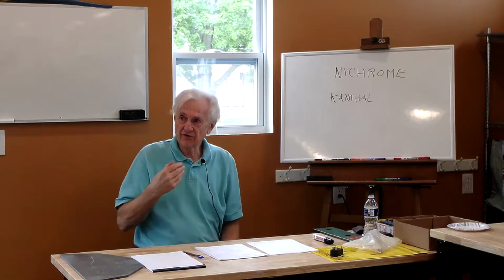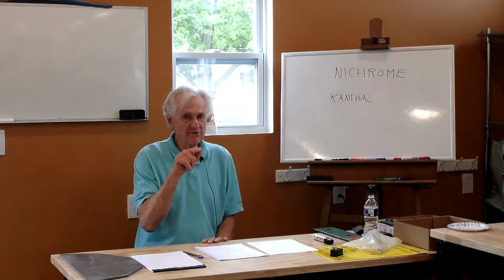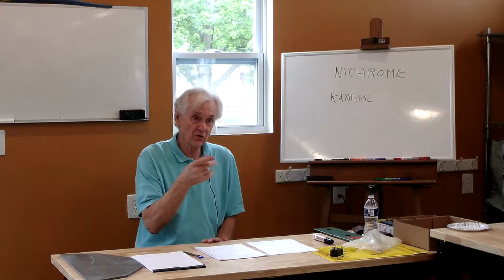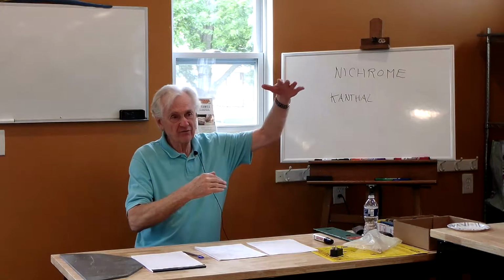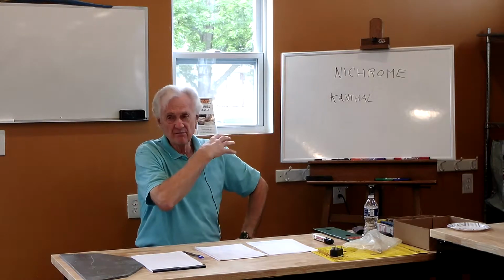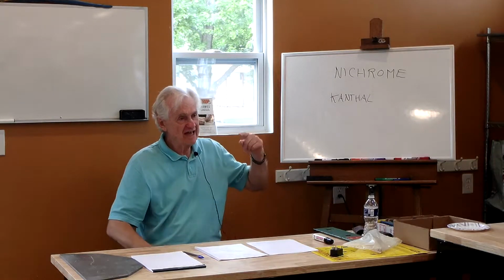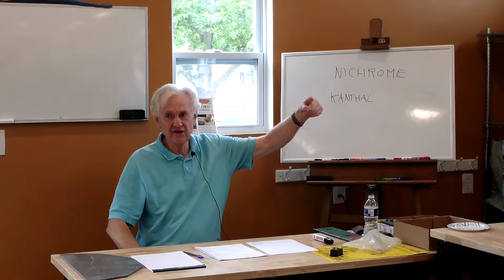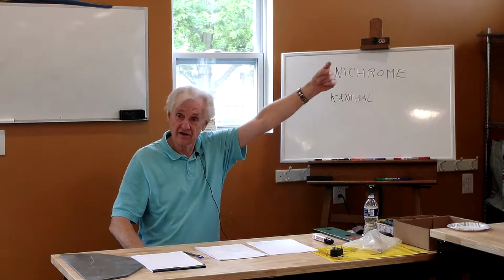And so the way a programmable or electronic controller works is there's a temperature measuring device, or more of them, in the kiln, and it measures the temperature. And the program, when they're calling it a program, it's a schedule. In the memory of the little computer that's built into the kiln, there's a schedule that says, after an hour, I should be at this temperature, and after 2 hours, I should be at this temperature, that kind of thing, okay?